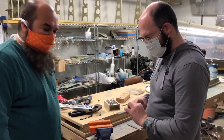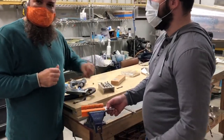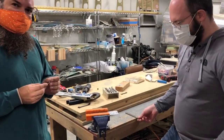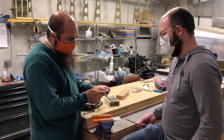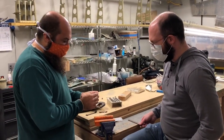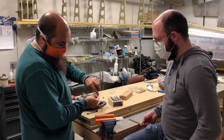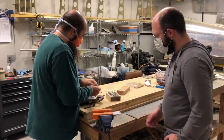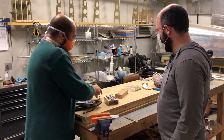Under-set means that you can fit the head inside the hole on the tool. Over-set means you squeezed it too much and the tool is now touching the plate. There are different types of tools — this one has a bunch of different sizes on it. I also have individual ones. Avery Tools makes these, and it's the same thing: there's the hole, which is a certain size, and on this end it's a cutout of a certain size — the same as this edge cutout. It's important that these be clean.